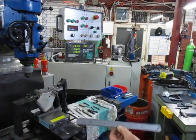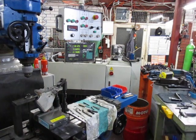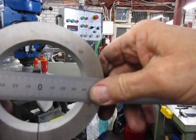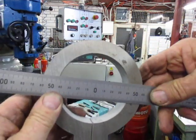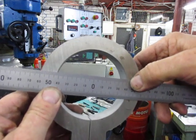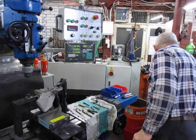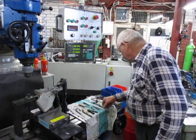And this is a very, very handy piece of equipment, because when you want to find something quickly in the centre, or you want to find out what the radius is, you can very quickly just slide that along, and you can hear we're getting 42 on either side. So it becomes very easy on round things as well to mark up your centres. So that's a handy little tool to have.